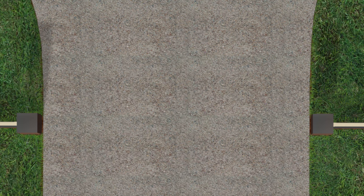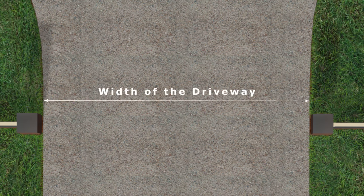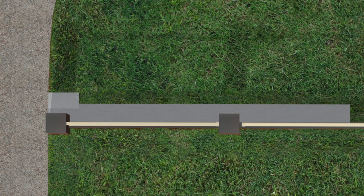To be more accurate, it's not actually the width of the driveway we use — it's the opening between the fence posts. The pad for the motor must be hard up against the driveway, at least 400 millimeters wide and the same from the back of the fence.